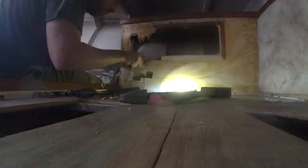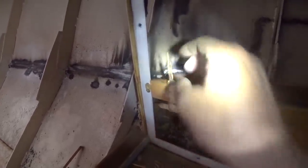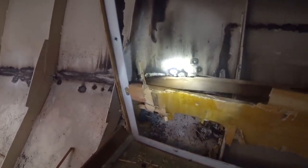Lump hammer is an excellent tool for removing carpet. And behind the carpet are bolt heads holding this onto some steel, with that really odd sized nut on the end and flat heads here as well. Here's a classic example of what's going on: this timber frame is bolted to the metal frame, then there was a plywood going over the top which is glued and screwed to the frame. So you literally have to break it to undo the frame. There's no way to have ever done an inspection for rust, no way to quickly get in and repair a leak at sea. I think this is a bit of a shocker of a design.